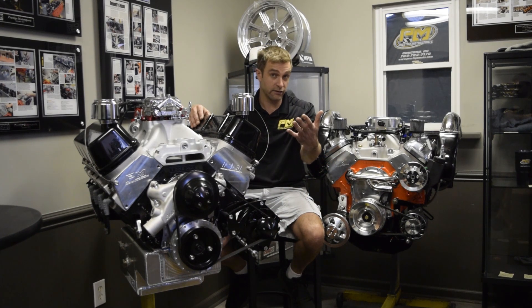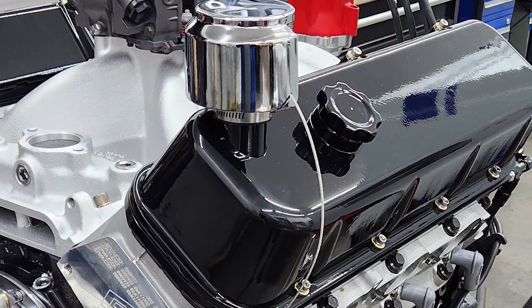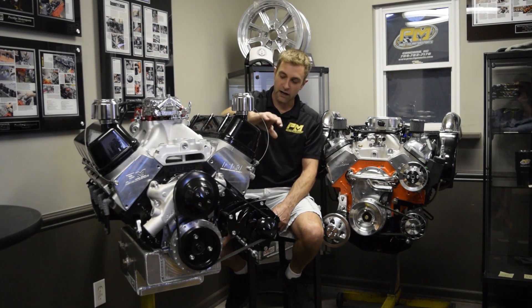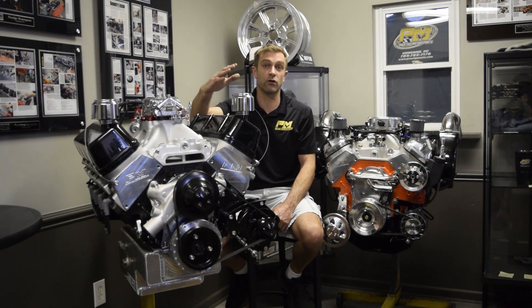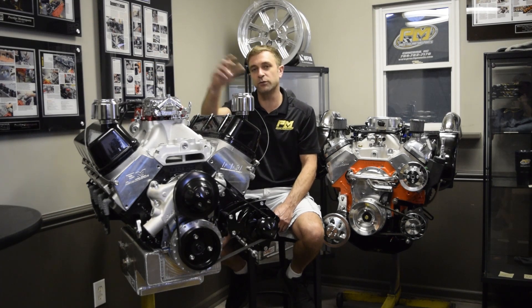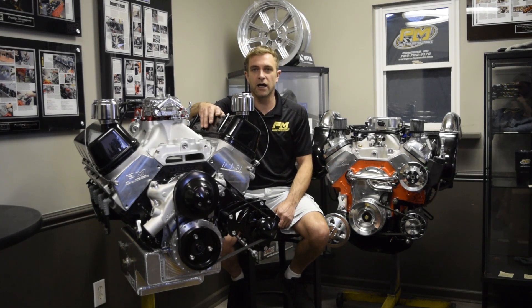Those can be changed to billet if you prefer a polished look. The valve cover option also typically comes standard polished — this one, the customer upgraded to a black powder coat option. These are our custom-built valve covers, so it's got the forward upright breathers, a fill cap, and typically a fill cap on both sides. The oil pans also have a sight glass as well as a dipstick option. Sometimes these are twin-engine airboats, or trips, or quad motors, so the reason for fill caps, sight glass, and dipstick provisions on both sides is so they can interchange what side that motor is on the boat, giving interchangeability depending on the configuration.